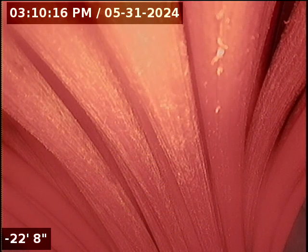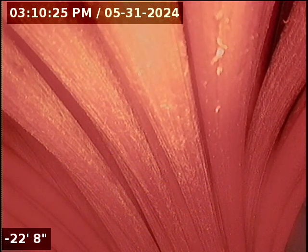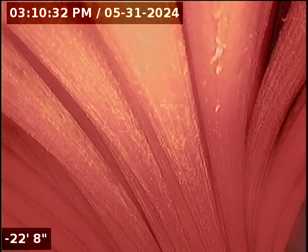Anyway, that is a way you might potentially be able to get past that separation, but I don't give it a super confident vote — it's possible. Getting back to what we had recommended earlier, just seeing the condition this line is in going down the back hillside — we haven't even gotten to the nastiest part of where that line's traveling yet. Unless this thing hits a main very close to the back of this house, it's going to be traveling through the woods back there. Where we're at right now, we already have root intrusions at the start of the concrete, and there's hardly a tree in the vicinity of where the line is. So as we make our way down that hillside, I would not be surprised to see the damage from root intrusions increase significantly.